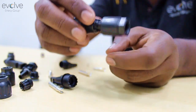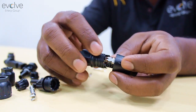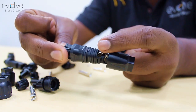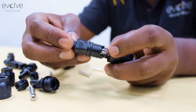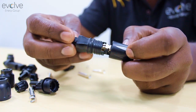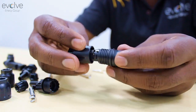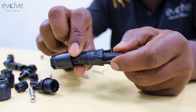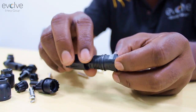Now I'm going to introduce you to something new. Look at this contact — it comes with a setup where you don't need a crimping tool. This is one single setup; the contact is already inside. You just have to put your cable in, press this metal piece with your index finger, and it's going to simply crimp the cable. Then you just tighten it and you're done. This is again of good quality and from a very good company, and it can reduce your time of installation.